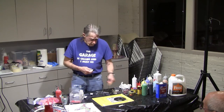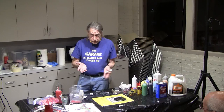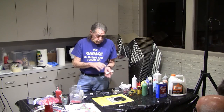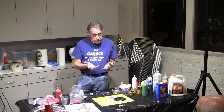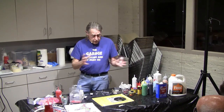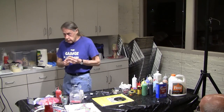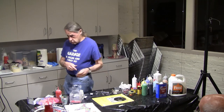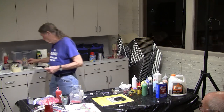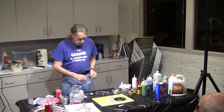Oh, yeah. Like those up there, I put lacquer on there. And you put 6 or 7 coats of lacquer on top of there. You put one coat of lacquer gloss on there and the colors pop just a little bit. You stack 3 more coats up on top of that and the colors pop out even more. The colors are going on top of lacquer. Yes. Bleed into that. Yeah.